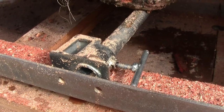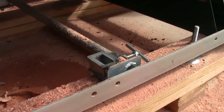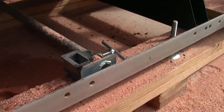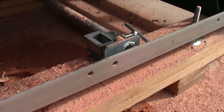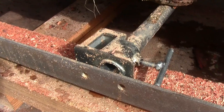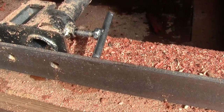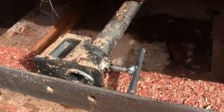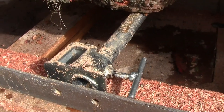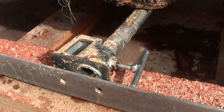And for me on the Bobcat, I still got the plate, the mounting plate. So I try to take the dogs out and I try to kind of pull these clamps back, lay them down flat like that, and put them over top of the rails, and that helps me kind of stay out of them. I wish I had done that before I got into this one. So someday I'll try to heat this up a little bit, see if I can bend it back in shape. But just a quick tip in case you do have one of these Woodland mills with these log clamps.